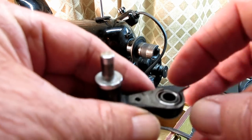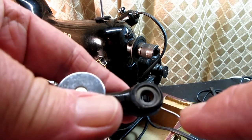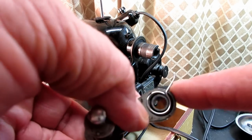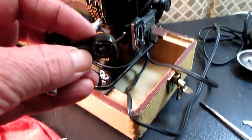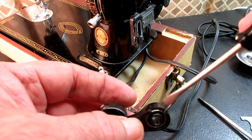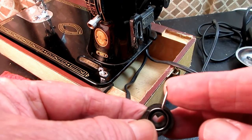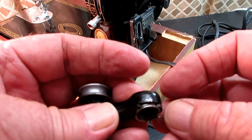And the way it stays in there is at the bottom of the spring is a 90 degree bend in what I'm going to call the spring tail, and it goes into a little hole there. So that end of the spring is held in place, and this arm, so to speak, or finger of the spring is, let's see, tilt this down, I don't know if this will show. There's a little cut out area right here, a little section cut out about 3/8 of an inch or so, and the spring goes up in there and rests. So when you want to take it out, you can push on the spring a little and pop it out of that recessed area. You can see the spring starting to come out.